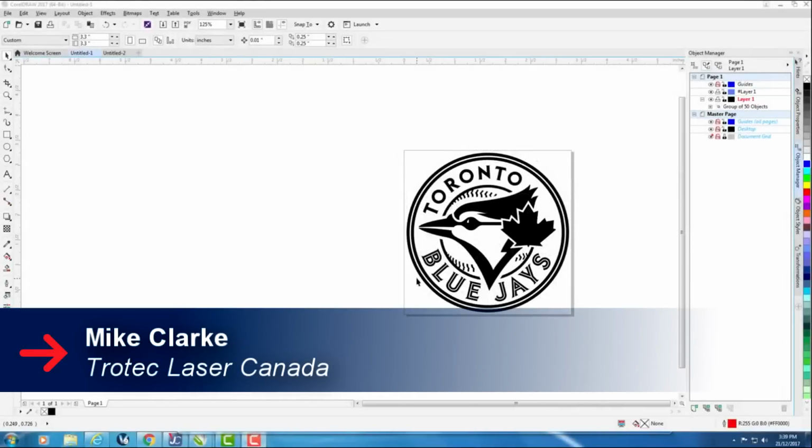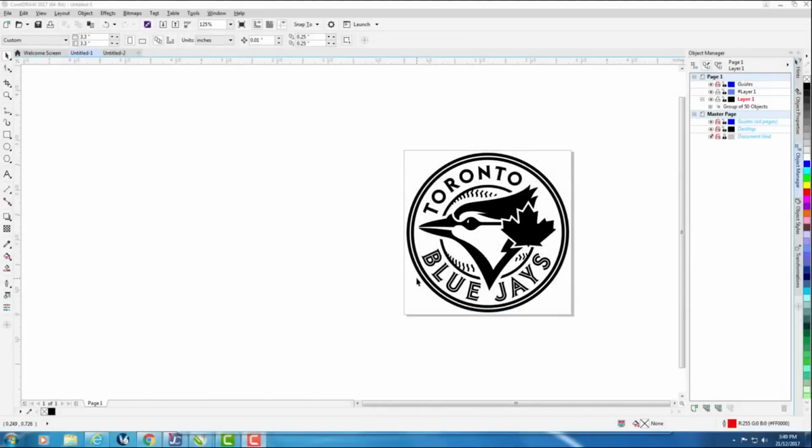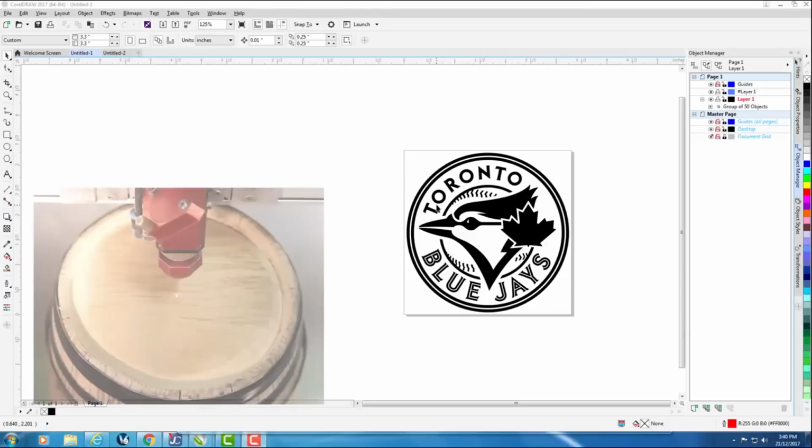In this training video, we're going to take a look at how to take this logo here and place it on an irregular shaped object. When it comes to laser engraving, one of the harder things to do is to actually place a logo and get it in the proper position on an item where you don't have an actual location that's known. For example, the product that we're going to be using here is the top of a barrel, and it's basically round, which forces us not to be able to push it up against the top left-hand corner.